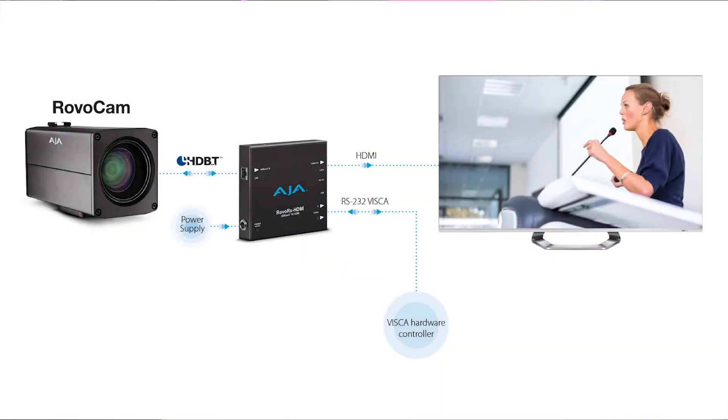Within the software there is also an ability to use electronic PTZ. So if the camera is locked off in one position but you want to use that 4K geometry to zoom into a particular area, we can do that electronically — no moving parts — using the UHD image to make a crop. We can even record the movements of that crop, so if you're shooting a parliament and want to zoom into a particular figure and then zoom back out, that movement can be recorded. We can even lock off things like contrast control in that environment as well.